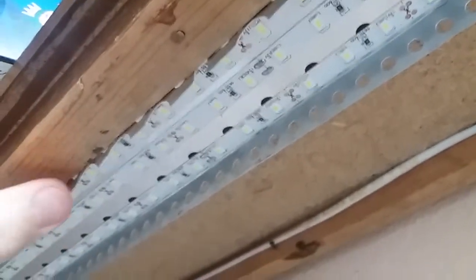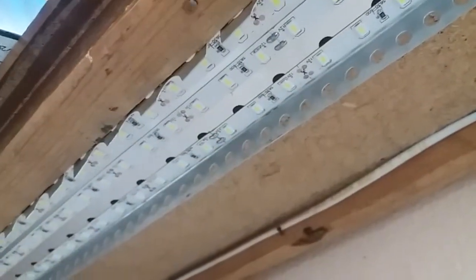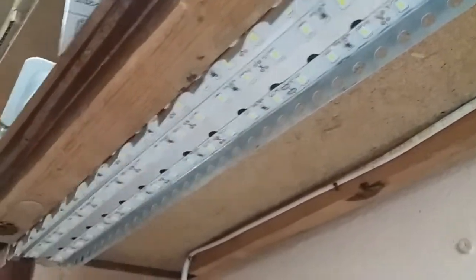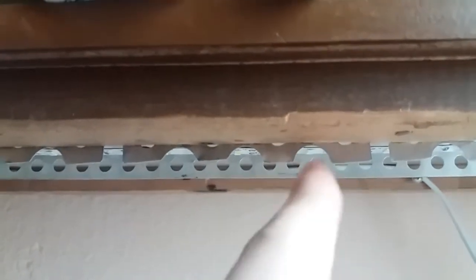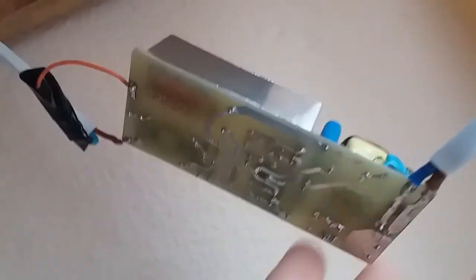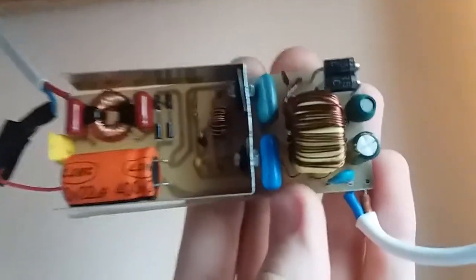It's a kind of pro tip for you: if you use these 5730 LED strips, they do heat a lot, so it's a good idea to stick them on a surface which can dissipate the heat away — in my case, this aluminum piece. I spent some time with a little file and filed down every sharp edge, so there's really no risk of harm. That's the power supply itself, and the switch I'm using actually cuts both lines, so it's safe to touch there. Normally you shouldn't do that, but in my case it's alright.